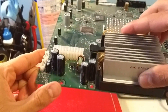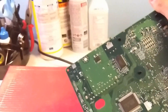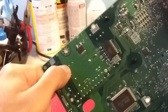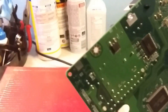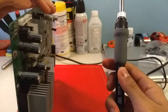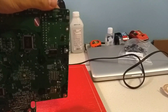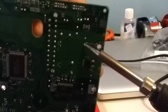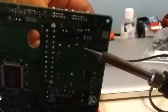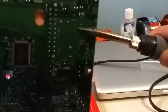This part is going to be a bit annoying. I'm going to position the motherboard on its side. With my left hand I'll hold the capacitors, first locating the other end on the bottom of the motherboard. My left hand holds the capacitor in place, and my right hand holds the soldering iron. I'll try to heat both leads at the same time, and once they're melting a little I can wiggle the capacitor with my left hand and slowly pull it out. One big mistake to avoid: do not use a very thin soldering iron tip — it has poor surface area and takes a lot of effort to heat the board.